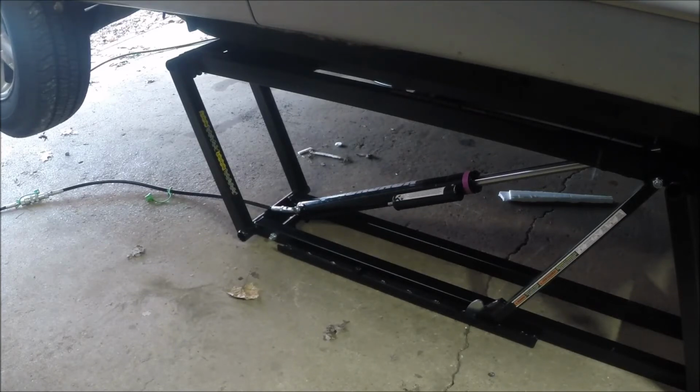So if you get into a situation where you're positioning the frames under the car, you raise it up a little bit, and if they don't stay even, drop them back down again and start from scratch. When you raise them up, that way both frames come up even, and don't stop until you clear the first lock. So don't go up, you know, 4 or 5 inches and let the thing sit there against the valves. You want to get up on your first lift past the first safety lock. And then if you want to have a look at things, you can let it sit back against the safety lock. And then the next step is to go all the way to maximum lift.